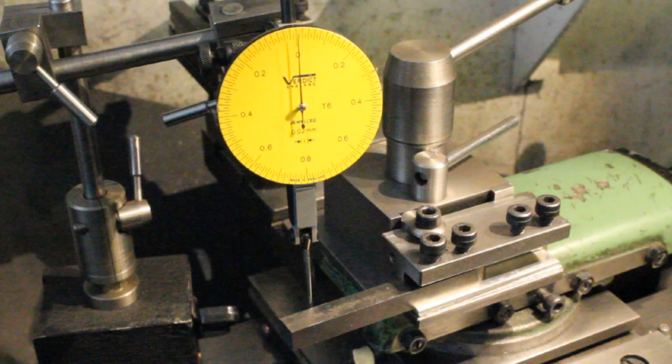One important aspect of the design for the home workshop is that there is very much less milling to be carried out. The groove for the cutting tool in the tool holder being the only major one. This means that it would not be an impossible task for the lathe only workshop owner. You can see from the following slides how the half round grooves in the holders were made — much simpler than machining large amounts of metal away to produce the dovetails. Having mentioned dovetails, I consider my locating surfaces also to be dovetails, while inverted and being very slightly curved.